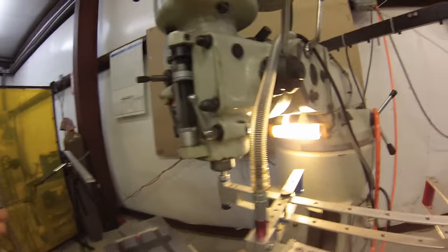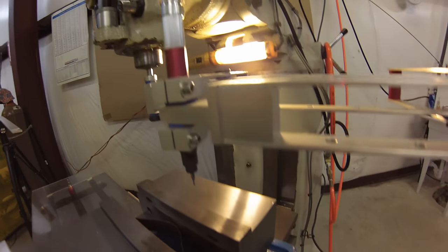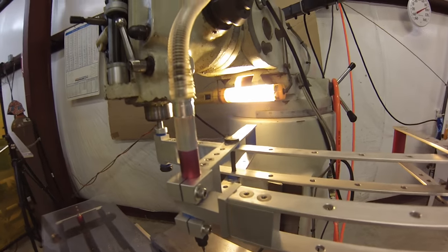And instead of an electric belt driven motor, which makes the whole thing more complex, I have a little pencil die grinder on there that's about a 40-50,000 RPM unit tied right into the air on the machine. I guess it took about a day and a half to make that rig.